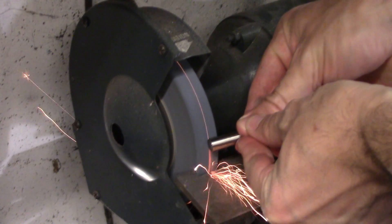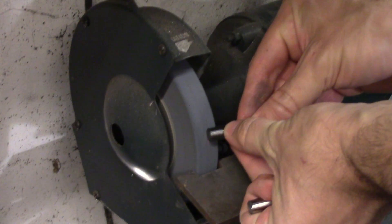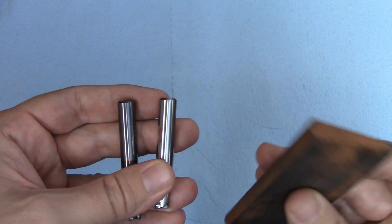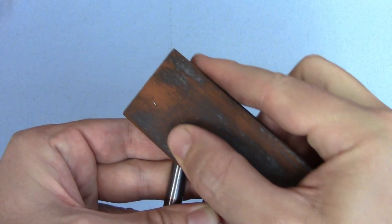Scrap carbide is actually very valuable, so you should definitely save it and send it in for recycling. There are several destructive tests you can do to determine what you have when sorting out your scrap. High speed steel grinds very easily and produces a lot of bright yellow sparks, while sparks from carbide are generally smaller and more orange. Quick safety note: grinding carbide is hazardous to the lungs, both chemically because of the cobalt binder and mechanically because of the sharp grains of carbide, so be sure to wear breathing protection. If you don't want to grind excessively on the tool, use a small sharpening stone on the shank — an aluminum oxide stone will easily scratch high speed steel, but it won't make much of a mark on carbide at all.